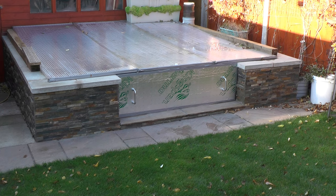You don't have to do it like I've done it, but that's cheap and cheerful. 50mm insulation on the window, 32mm 5-ply polycarb on the top, 9-inch of concrete block and 25mm Kingspan around the sides, and all the pipework is lagged. The only thing exposed is the Bakki shower.